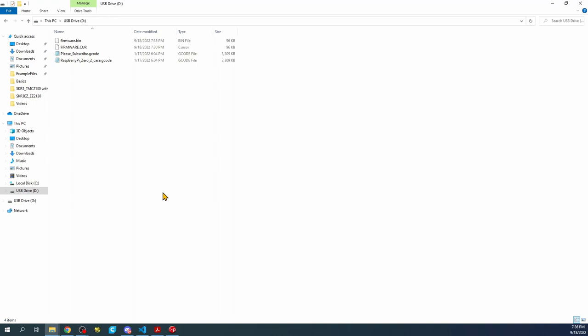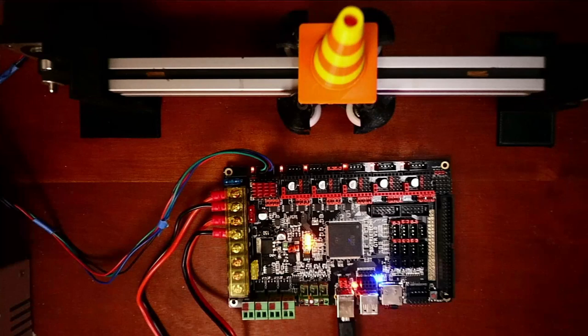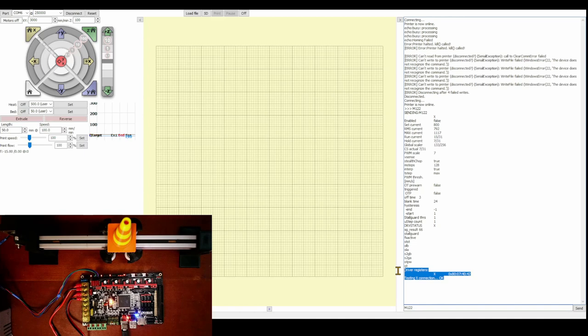Pop the drive out and go back to the workbench. Place the SD card back in the board, connect, and energize the board. I'd like to thank my patrons and PayPal supporters for making these tutorials possible — a thank you will be placed at the end of this video. Let's connect in Pronterface — printer is now online. Also check the M122 debug command, which confirms everything is okay. Now movement is going in the correct direction, and homing works successfully. If you like this tutorial, please press Like and subscribe. Thank you very much for your time.